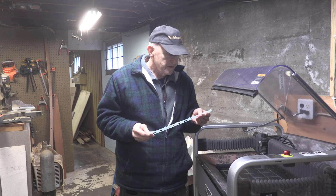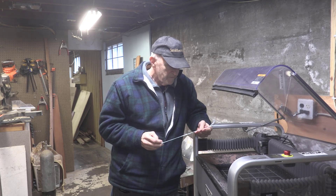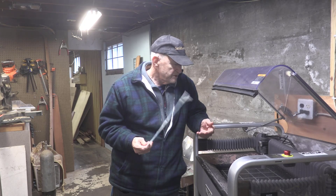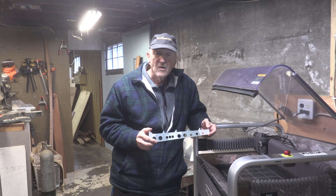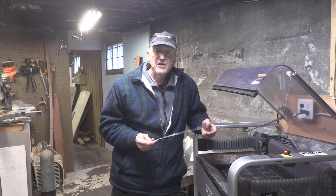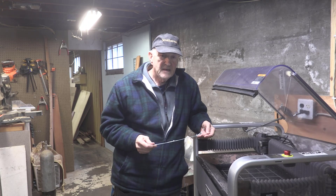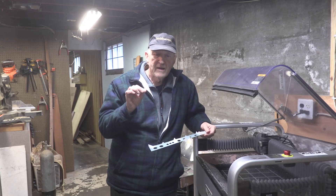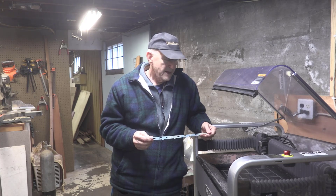So, how much of a problem is it? It's a problem obviously. I suppose there's no reason we couldn't just re-bond this stuff. I'm not going to use this — it's the thicker material anyway. I'm going to go ahead and cut this out of the 0.016 — the sixteen-thousandths-thick stuff. I'm going to take a chance that that will work okay, because the material is so thin that the water jet itself spends so little time over any spot that it will be able to successfully cut it and not have this kind of damage. We'll find that out as we move along.